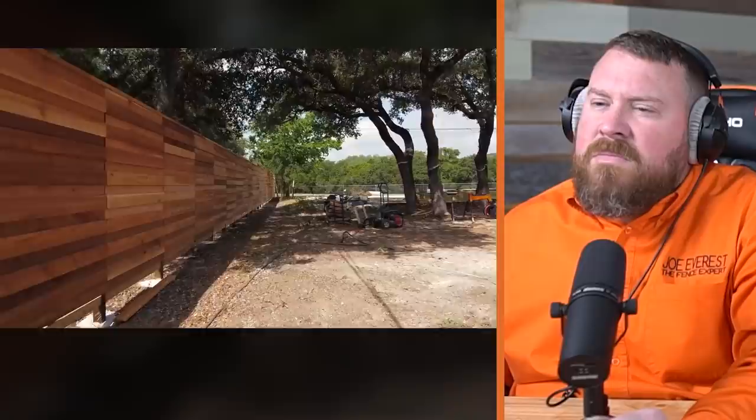You know, I'll add one thing. So she mentioned she's doing 6 foot because she's building a horizontal fence. Typically, anything over 6 feet tall, even if it's a vertical privacy fence, we'd still do posts at 6 foot spacings to try to give it more structural support.